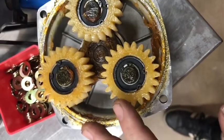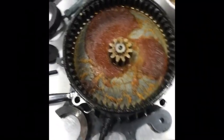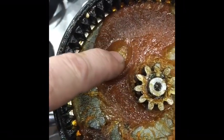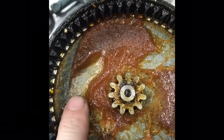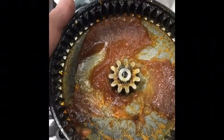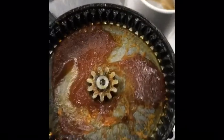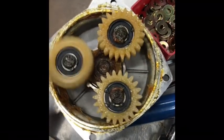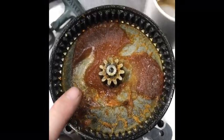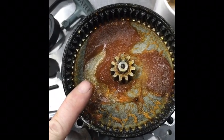If you have an older 30-tooth gearbox, the 22-tooth gears will not work. If you're switching from nylon planetary gears to steel planetary gears, this grease in here should be cleaned up and replaced with a grease more suitable to steel components, such as a moly-based molybdenum disulfide wheel bearing grease or something of the like. If you put the plastic grease in here, it may not have as much lubricating capability. In general, it's just a bad idea to mix grease. Clean that out and put in some new fresh grease when you're ready to assemble.